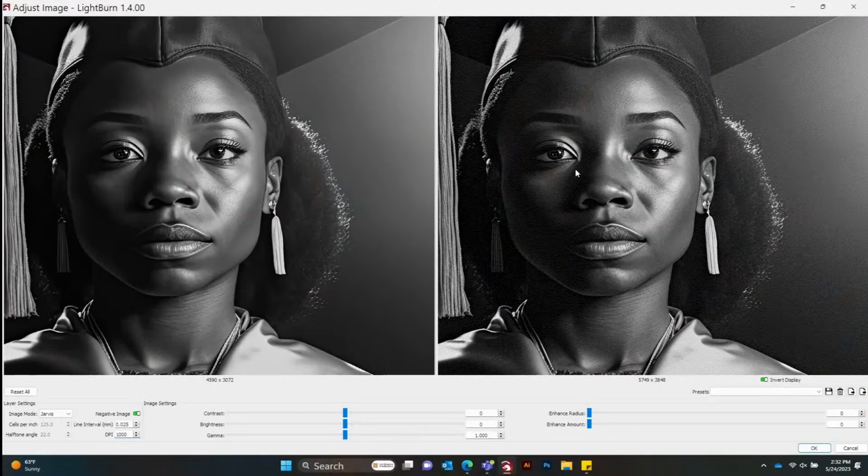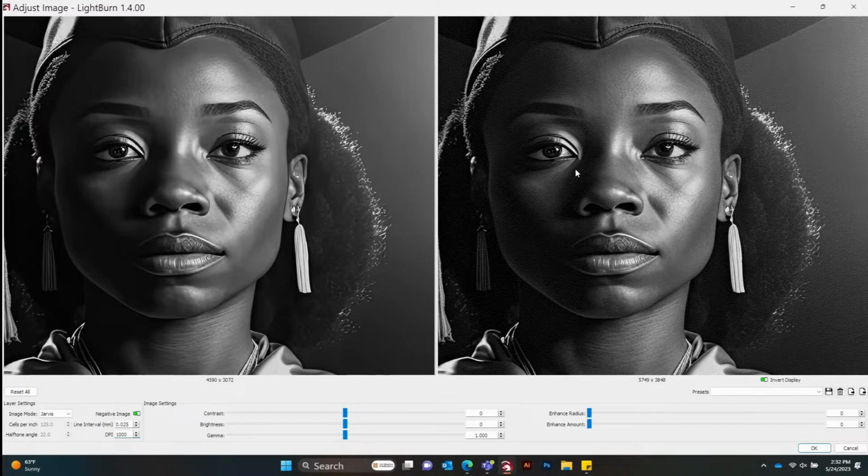So, down here in the bottom of the screen, you can change that DPI, and you can see where that's going to change things on the preview screen. You can bump that all the way up to even 1,000 DPI. It looks kind of funky in the preview, but if you zoom in, you can see the amazing details that brings. Unfortunately, that's just in this digital view space. There are some materials that you would be able to get that kind of crisp, clean look on. Granite is not one of them, at least I have not personally had success with.